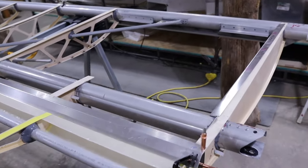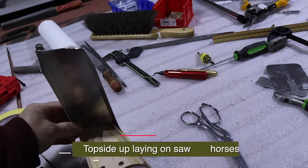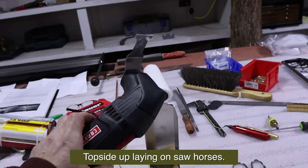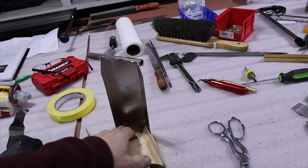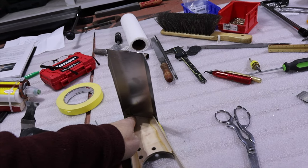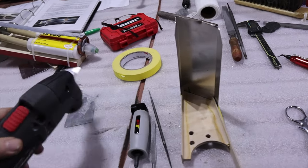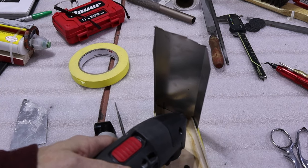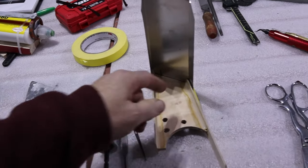Chain drilling all those would have taken quite a bit of time, so I made a little mock-up for you. You flip the wing upside down - pretend the spar is right here - and use one of these oscillating saws with a bi-metal bit. It worked really well. You figure out the height of what you want your slots, mark the inside where you can see it, then make your first cut, always starting at the top of the cap strip on the lower side of the rib. You stick your saw on there and run it up that line, and once you're getting closer to the top, to keep from hitting the top cap you just push it in a little bit deeper and get right up that line no problem.